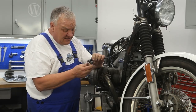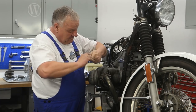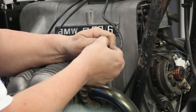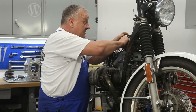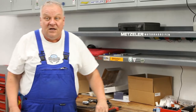Next thing — about these plug wires, have a look at these things. You can unscrew the connector. This is an NGK. These are pretty beat and they're kind of the wrong color. I'm going to make up some new plug wires. I'm going to show you how to build some spark plug wires out of individual components. They're available in complete assembly for BMW, but this is a much more cost-effective way, and the end result is really very good and easy to do.